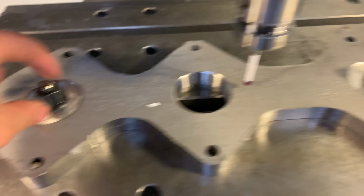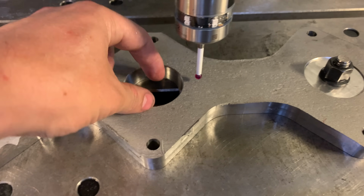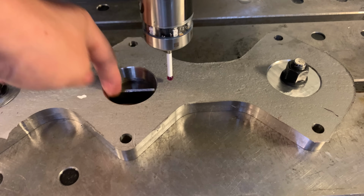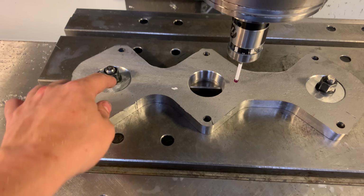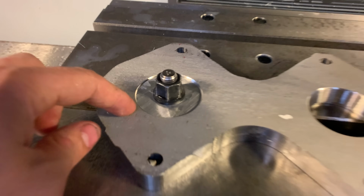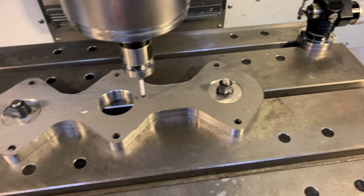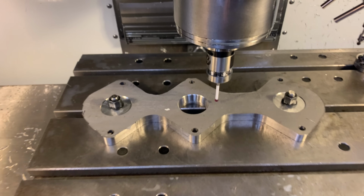This is my 5 in the morning adventure. I've made 2 little aluminum spacers, but they're not really spacers. They're just this angle, the exact same piece flipped inside out with a 1/2 inch hole drilled through them. So they are holding the piece in place. That's the goal. This one I used to figure out where it's at, and these 2 are holding it in place. We're gonna see if I can do this whole backside without anything clamping any of these corners down, so we get a nice, consistent, smooth finish. These are sunk down just the slightest bit, so they probably won't affect the metal too much, but I'm gonna do a long 2-hour pass to get a nice smooth finish on the backside, and then we'll take this last edge down and clean it up and see what we get.